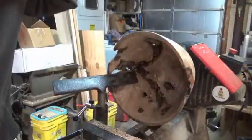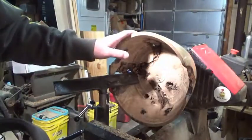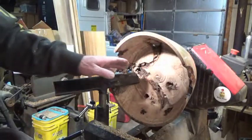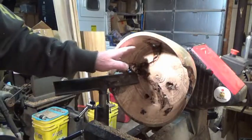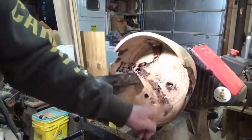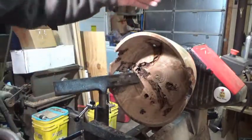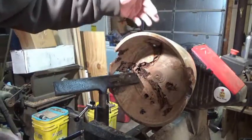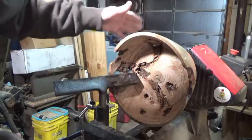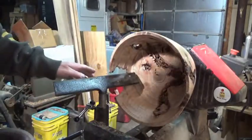Oh my goodness, what I just went through. I had a little wobble in it, almost 1/4 inch. And if you watch my videos, you see me blow through the side of one. That is what's caused by that, because it's cutting more on this side than it is on this side. So after about a half hour of playing with the screws in the back, shimming, unshimming, switching screws, fixing stripped out screws, I finally got it where it's running true again. At least close enough for my camp.